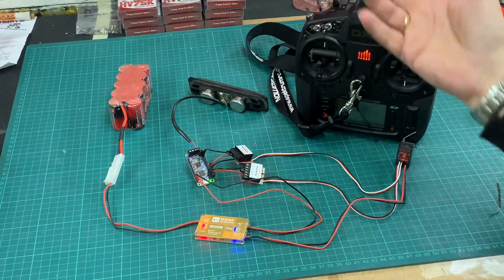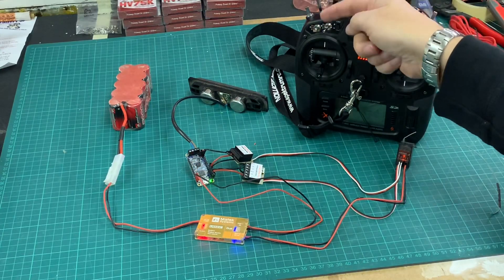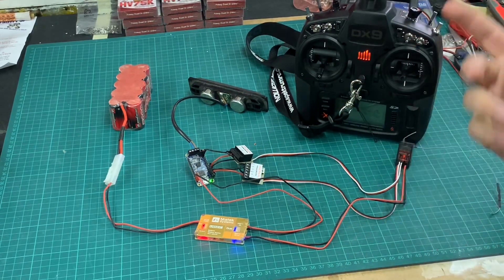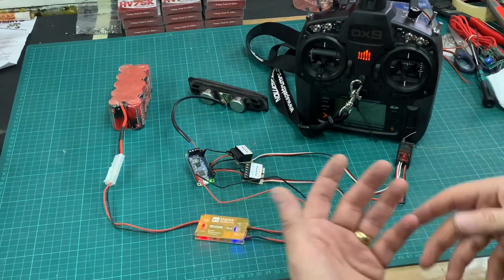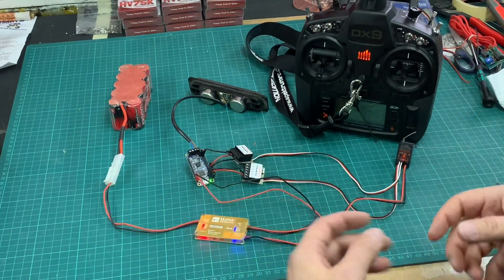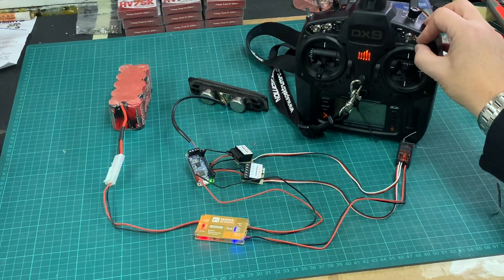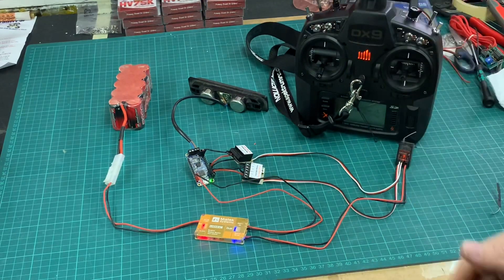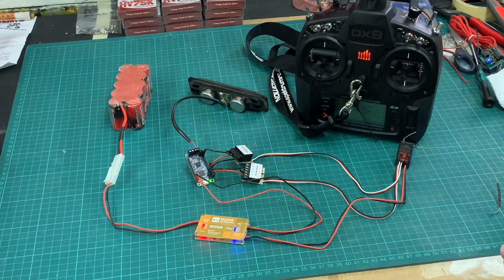If I leave it up it'll just cycle through the sounds. I've also got a trigger for downwards on this switch which resets the board. So if the sound's going on too long — say he's being interviewed and someone's talking to him — I can cut the sound short so it doesn't crash into them talking. I'll trigger off a longer sound and just kill it by pushing down. It's a reset on the board but a nice way of quickly cutting the sound short.